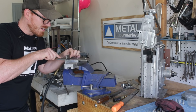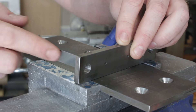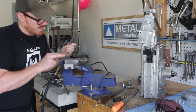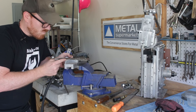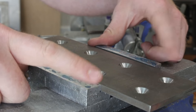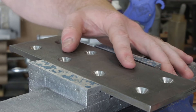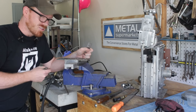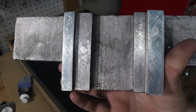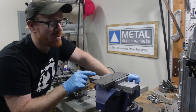I had a piece of quarter inch steel — a piece of six millimeter cold rolled steel — so I used the quarter inch, which is a little larger thickness, and the belt sander to get it down close. Now I'm very close and I've switched over to scraping. This is about ten thousandths of an inch away on the thicker side and about five thousandths of an inch away on the side that's closer. So now I need to scrape this down, scraping more times on the side that's farther away.